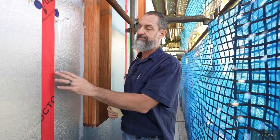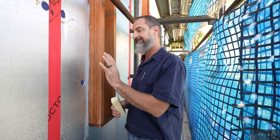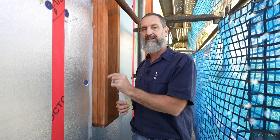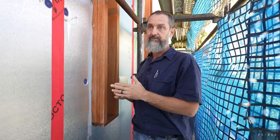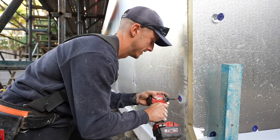After we've installed all this, the boys have taped all the joints. The next process on this job is putting hardwood 45 millimetre hardwood battens over this insulation — they'll get screwed all the way through into our CLT panel and that will create a cavity. I know there's going to be a lot of people asking why didn't you run your electrical wiring and services in that cavity. We didn't want the wiring there because it would have had to pass through the battens in certain locations, which meant there was a possibility it could have been penetrated by the screws when we screw all our cladding on. Being a solid house with no cavity, if something hit a wire or a pipe we would never find it — it would be an absolute nightmare to locate. By fixing all the services to the CLT panel we've been able to mark everything out strategically so it misses all of our battens, and when we screw our battens in we don't have to worry about the screws hitting anything.